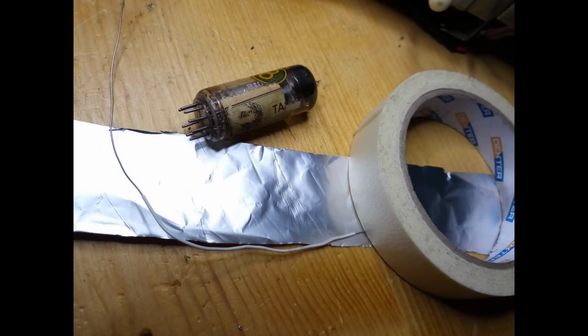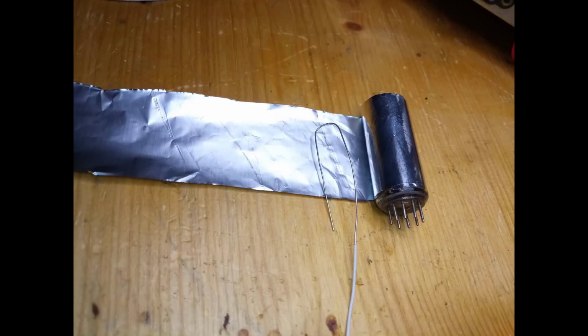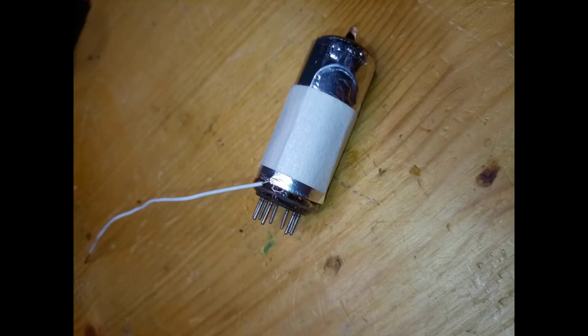This radio model has been designed focusing on making it cheap. There is no shielding between the first three vacuum tubes, and all the coils involved in the tuning and oscillator sections are not shielded either. Under the circumstances, the radio is very sensitive to electrical noise.